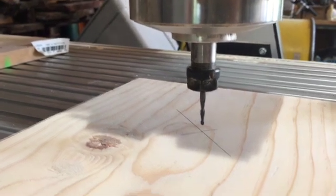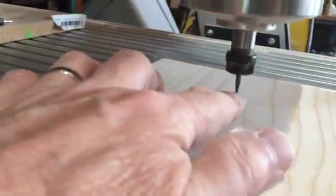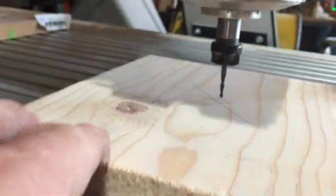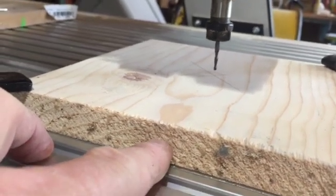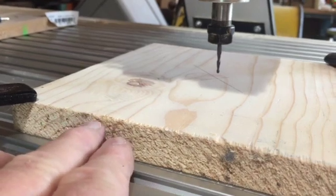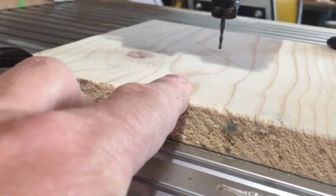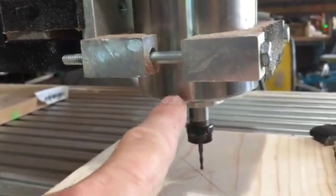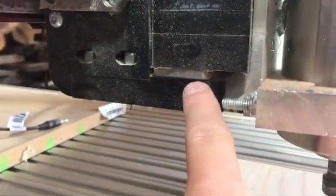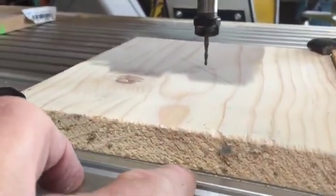I was asked the question the other day: when should I mount my spindle in relationship to the Z-axis? Take the shortest bit you've got — in my case this one, it's an 8-inch bed. Put the littlest workpiece you would work on and carve it on your bed. Most beds have a spoilboard which is three quarters of an inch — these boards are three quarters. So I'm going to want to mount my spindle low enough that when it's all the way down on the carriage, that bit would basically almost cut through into the table.